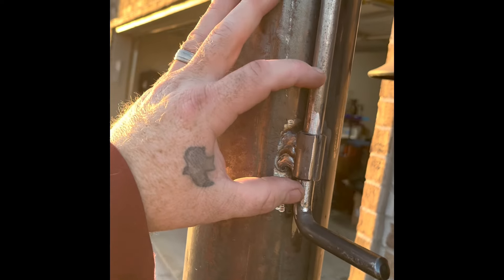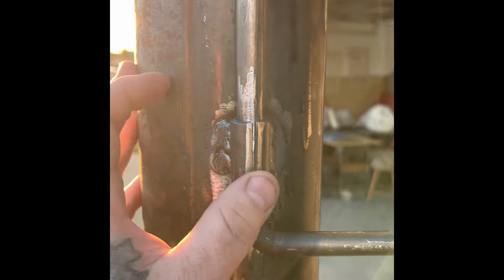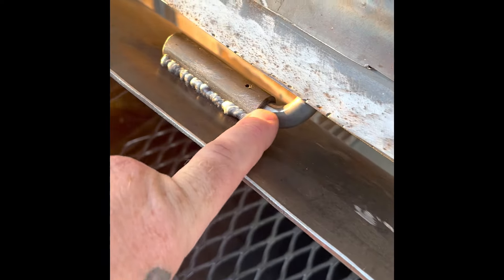This thing kind of gave me a pain in the butt. I did one other one and didn't have a problem. I didn't want to waste material — I'm trying to learn to use just enough material to get the job done. What happened was it bound up, it wouldn't rotate. So I ended up having to just cut a seam and split it apart, because the inner diameter of the tube was about the same as the inner post, which can be kind of nice for tight hinges, but that may have been the problem. I may need to give a little bit more leeway or grind these inner swivel points a little bit more skinny, because when I got it in there it wouldn't rotate. I'm also realizing that when metal gets hot it expands, so maybe if I had waited overnight it might've cooled down and rotated.